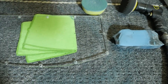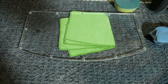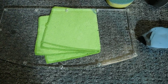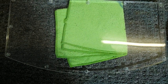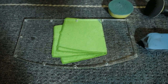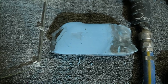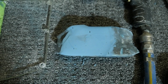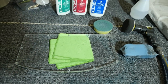And compared to when I polished the reservoir, polishing this using the cutting compound, polishing the base, was so much quicker and easier. So if you run into this same problem and you find that the gap between the 2500 and that coarse sponge is too great, it's taking too long, well then use a metal cutting compound. And this is actually for polishing aluminium. But really anything for polishing steel, whatever it is, it seems to work very well because I tried a few of them.